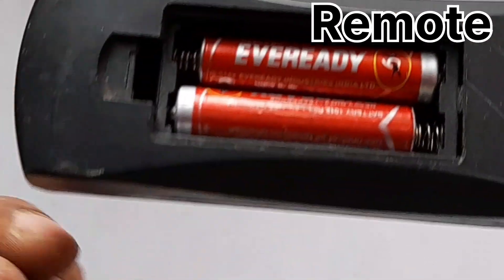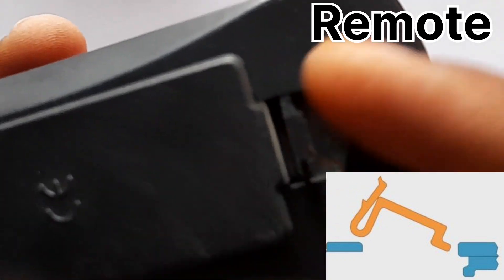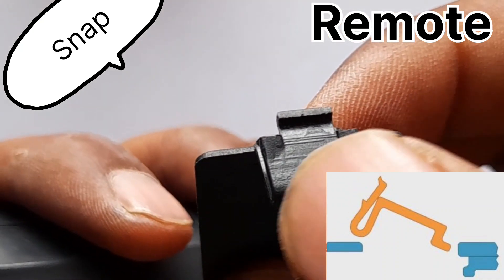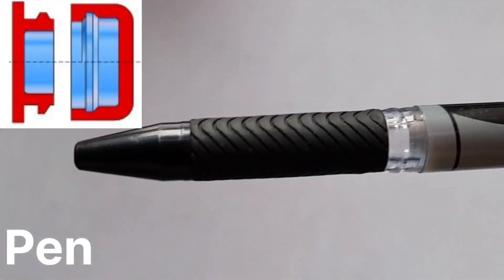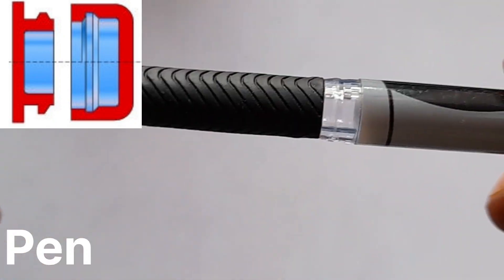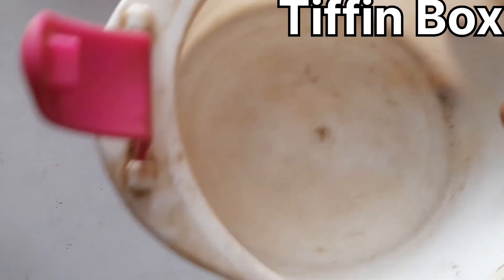The next example is another television remote design. You put the remote in and press it — it gets locked. Once you unlock it, it releases. You can see two projections functioning as snaps. There is also a round profile that acts as a round snap — once you press it, it locks in place.